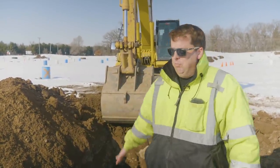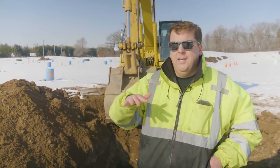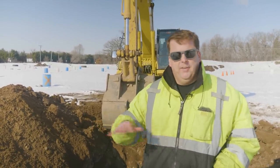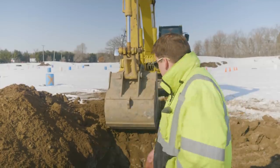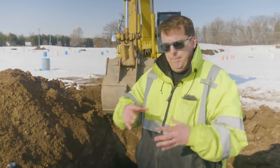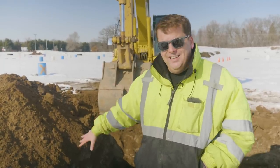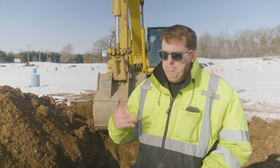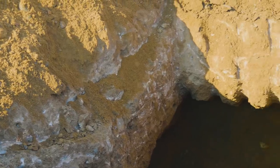So that was digging through regular frost with no treatment on the ground. For a contractor going out, you'd probably want to heat the ground — you can do different treatments like putting a tent over the area, heated mats, things like that. But I just wanted to show you how you can get through it. We've got a good probably five feet of frost, and when you look down there you can see there's a little bit of a cavern — that's what I was trying to build, that opening underneath, so I can put downward pressure and break it up more easily. Now that I have that entry hole done, it would be a lot easier to keep going to make this a longer trench. But it does still beat down the machine. Look over on this side — you can see a solid frost layer.